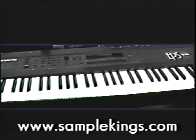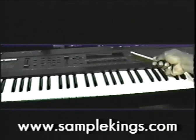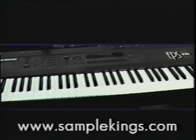To the right of the display panel is our Effect Select Bypass button. This acts as the master controlling switch for the built-in effects of the EPS 16 Plus. The playback rate and polyphony of your unit will change depending on the effect that you have selected. Some effects will allow you to play up to 20 notes, while other effects may only allow you 7. Please note that original EPS users will not have this function available to them.